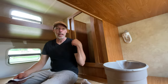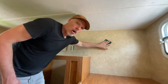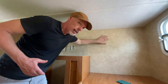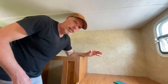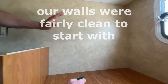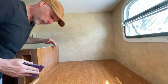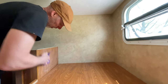We're going to use a scratch pad to scuff up the wallpaper — you can lightly sand it too. It's dry, just removing any dirt and slightly scuffing it for better adhesion with the primer. After scuffing, we'll take some clean water with a damp cloth and wipe it down, then let it dry. Normally you go with the grain of the wood, but this is that fake wallpaper so I don't think it really matters. Every little bit helps — you're cleaning the walls so everything adheres.